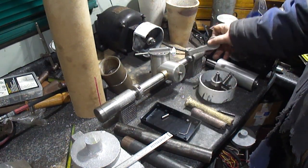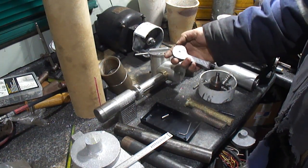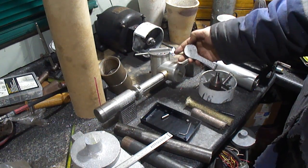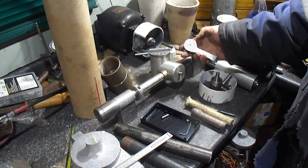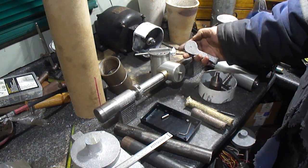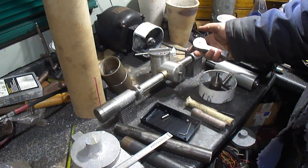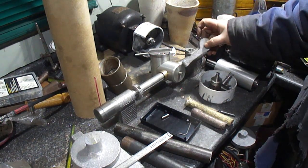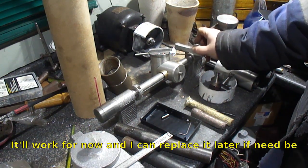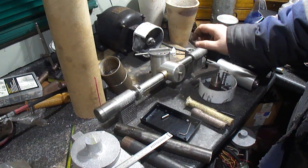This is the backstop arm. I was going to make a clamping setup so it was split, bore this out to 1 inch, and then add a screw to pull it together and clamp it, but there's not enough material. I kind of screwed up a little bit, and when I designed the pattern I made it for the final part and didn't allow shrinkage allowances or anything like that, and had to clean up a bit off that flashing, so that screwed me. So instead, I'm just going to drill in the top and add a thumb screw, brass tipped, to lock it to the shaft. Because I don't need super high torque to hold onto this thing. Because I'm not planning on wrenching back and just slamming it back.